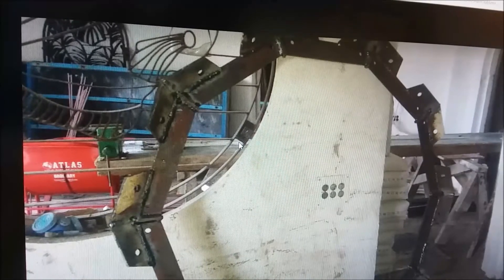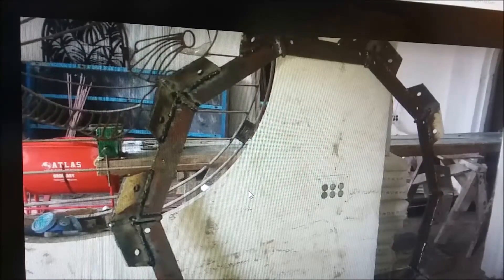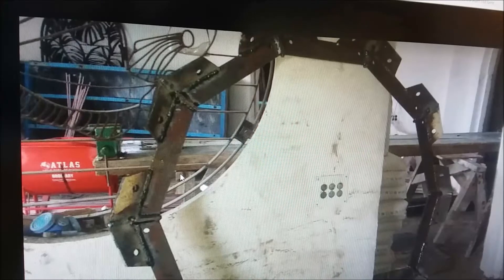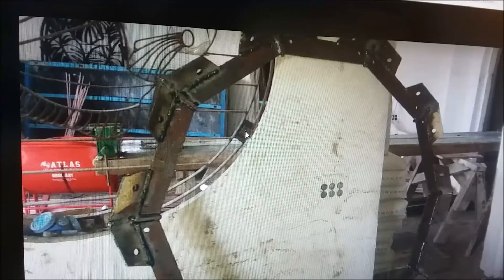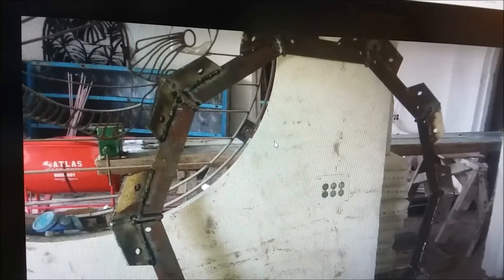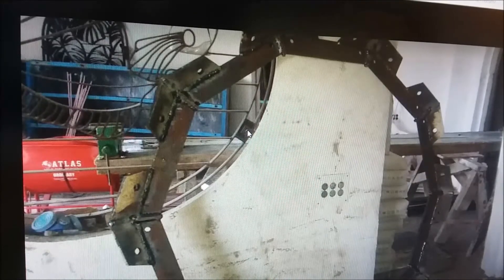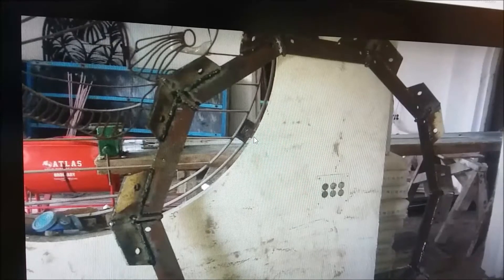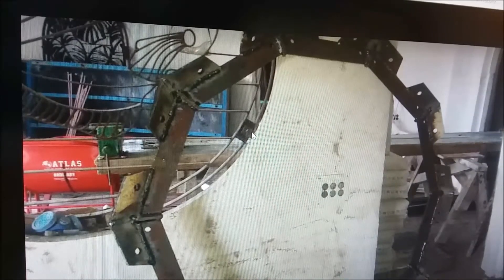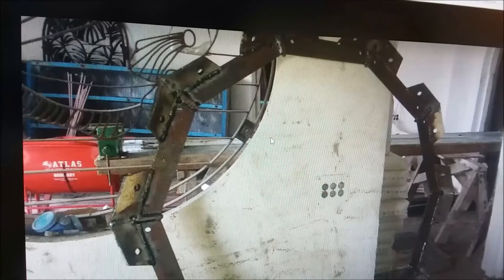This grill is not actually mounted into the wall yet — it fits much closer. There's a tab on the back that goes into the wall, with a piece of rebar welded to it that goes six inches into solid concrete. Every other bolt is an Allen bolt — it takes two kinds of wrenches to get one of these grills out of the wall. Or you'd have to grind off all the threaded rods at least halfway around before you could slide it out. That's our mounting scheme — ought to confuse the enemy.